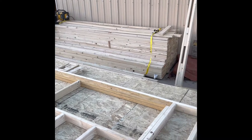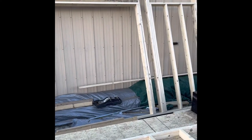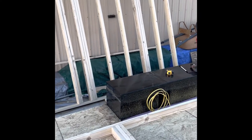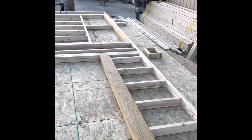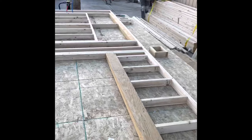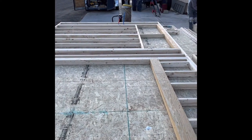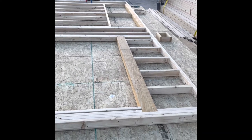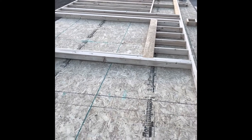We're cleaning up here — it's been a long, windy day, so we are tired and ready to go find some food. Here's one last shot of the 2x6 wall that they were really hoping to get up today, but weather did not permit that. And one more shot of the 2x4 wall — this is a really good shot where you can see the LVLs and how he has used the studs to support that wall and those LVLs. That's going to be a 7x8 door there. He's got lots of studs making sure everything stays nice and square, and he fingered it out on the ends again and will fill that in with the next wall.